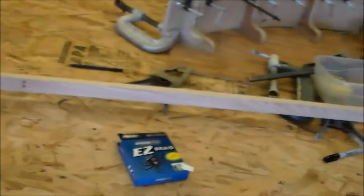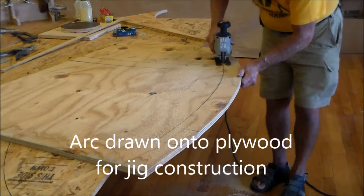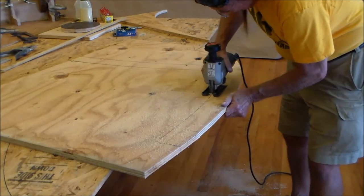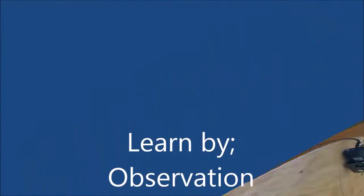Right here you can see the difference in the distance — it was falling short, so I made the adjustment at the top where it's basically flat. I ran the screw in over here off the edge and retied the end of the knot. I drew this arc onto a sheet of plywood that I'm going to cut out and use for my jig for bending the arc framework for the dome. Thanks for watching my friends, bye bye.